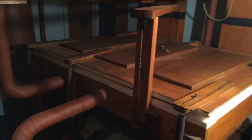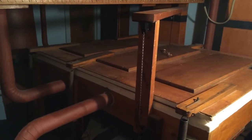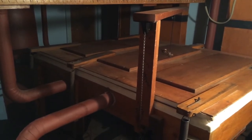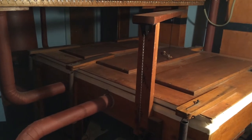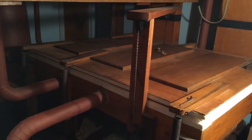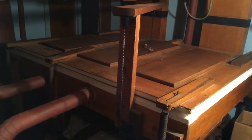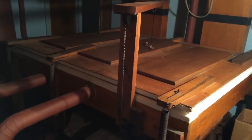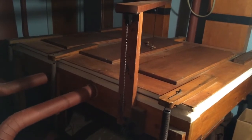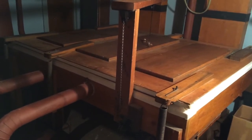The back door that you see in this picture is where the blower was located — this is where we came from just a few minutes ago. Once the air fills into the first primary wind chest, it's then distributed out to individual wind chests that are located under each division and helps regulate the air for each division. What we're seeing in front of us is the wind chest for the swell division. You can clearly see the boxes on top, and inside each of these boxes are the bricks that we talked about that help weigh down the wind chest and help create the air pressure. Once the organ is turned on, these wind chests will fill and will expand.